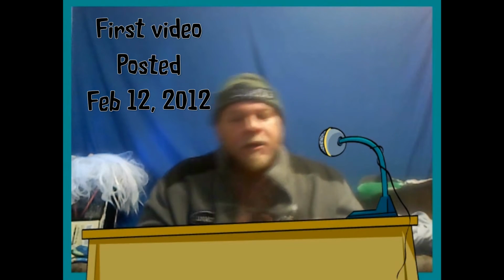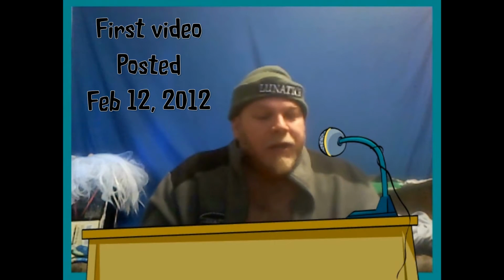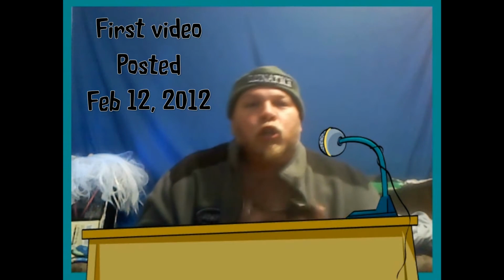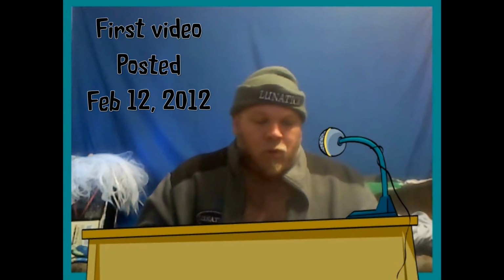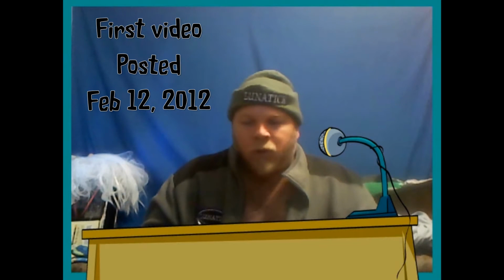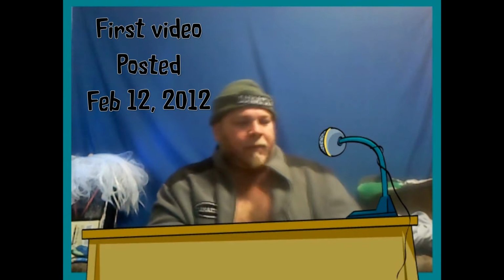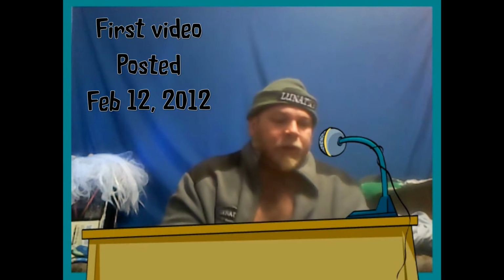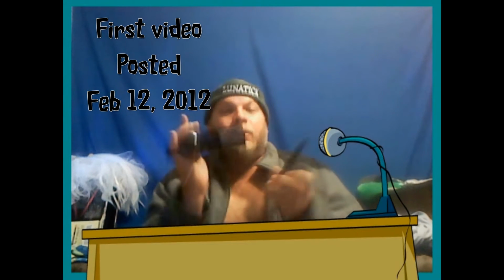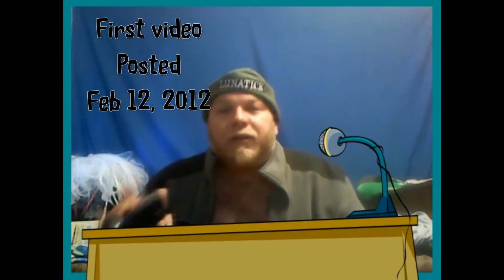Now, with the walkie-talkie that you've got plugged into your camera, turn the volume down to the low setting of 1. Turn it down to 1 because anything higher will just be distorted when it's recorded on the camera. So now you want to have your radio set to the same channel and go ahead and start recording something.